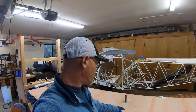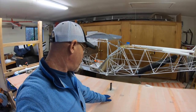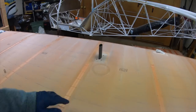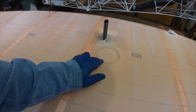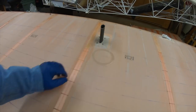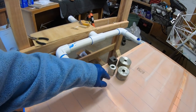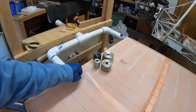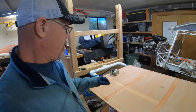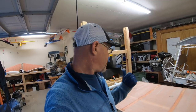I'm going to go ahead and put some of the access hole spots in the wings. You start by gluing down this plastic ring with poly tack right over the top of the fabric. Doing this one so I've got access to the pitot. Doing another one down here on a slightly uneven surface, so I've got some weights on it — that's to access the finger screen. That finger screen comes out with an elbow on it, so unless you do that you cannot unwind it. That's a good one to know — right up against the root.